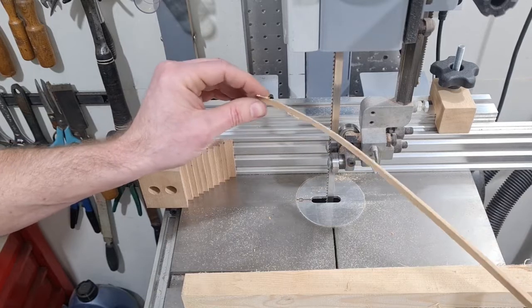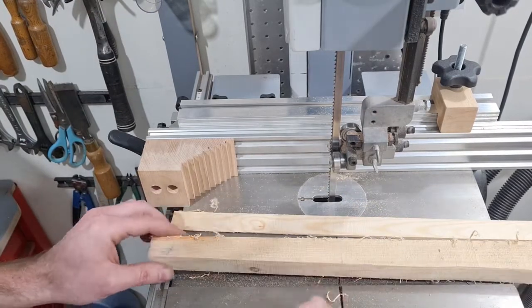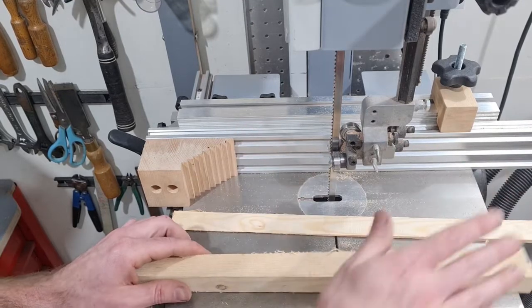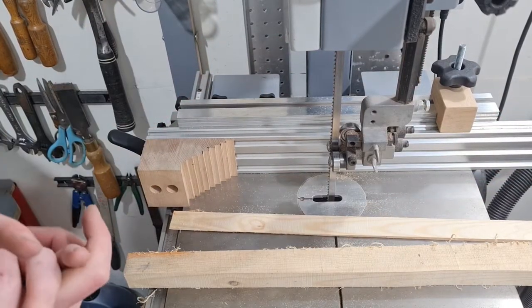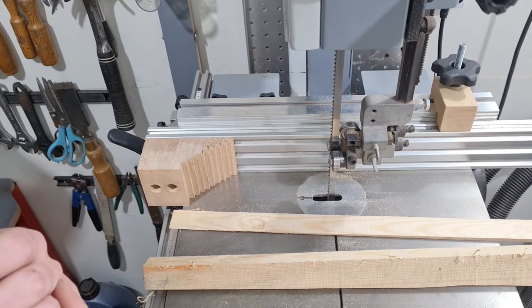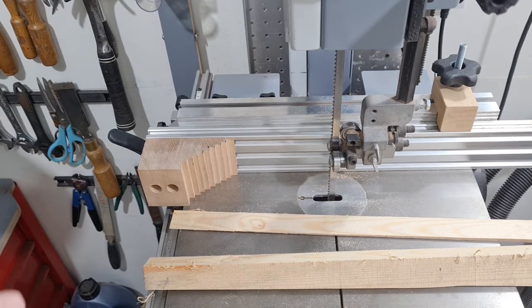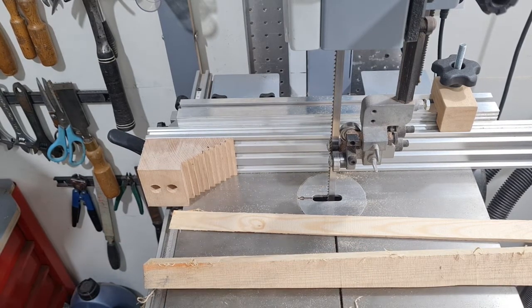It's almost like a fishing rod! It's also incredibly useful if you need to reference a straight edge — if you've got a piece of wood with quite a bow to it or a badly cut edge, by supporting it at either end you can have the wavy cut under here and rip it off to establish a straight edge. It's super useful not just for cutting tapers but also for truing up wonky wood, off cuts, packing wedges — anything you can't quite get into with a traditional mitre square when you need to work at much lower angles. This is absolutely worth the time to build.